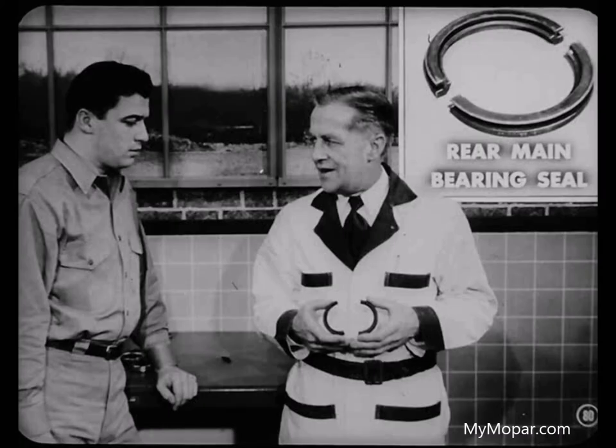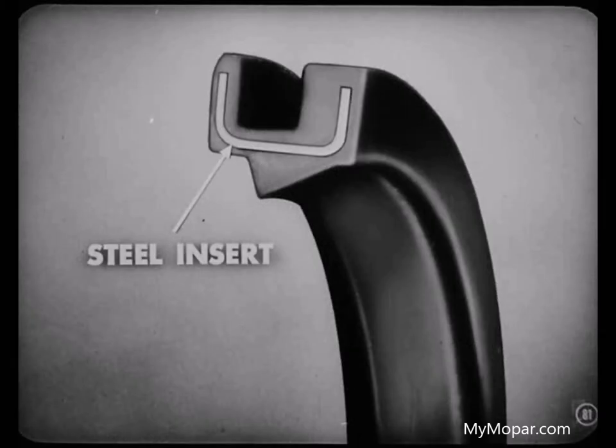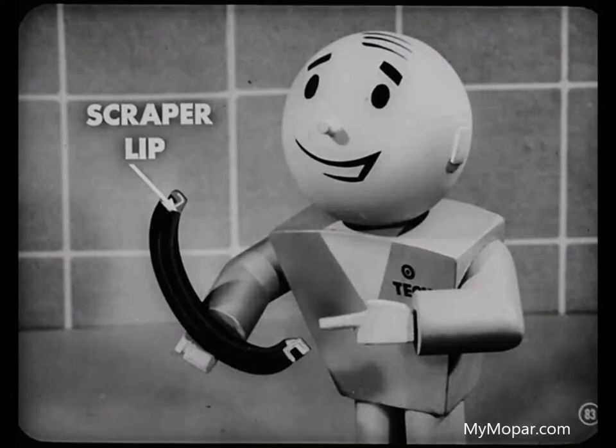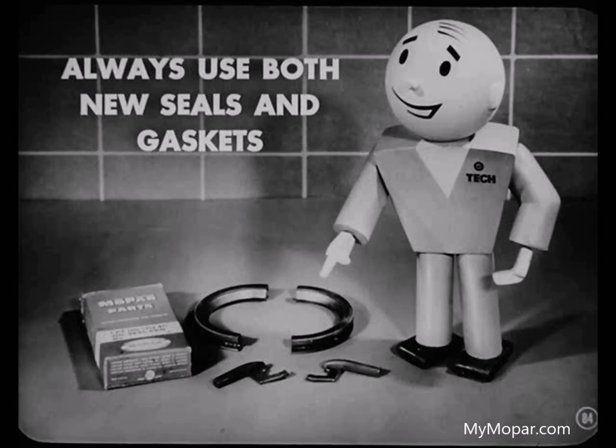That felt is held by a metal retainer welded to the pulley. Proper compression of the washer is mighty important — if too thick a washer is used, it'll burn up because of the friction, so always use a replacement washer of the right thickness. To remove the new type cover oil seal, be careful not to damage the cover when you drive out the old seal. Remove any paper gasket and carefully clean out the pocket. This new type cover oil seal fits only the 1953 model engines.